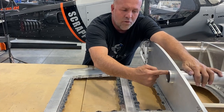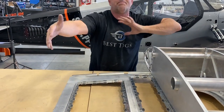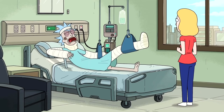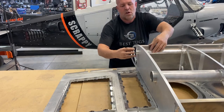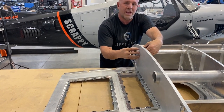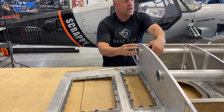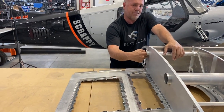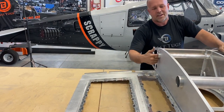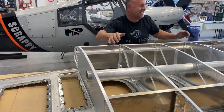Inside of it will be a torque tube, a half inch smaller diameter, that passes through that manipulates all the... This small tube you see here will have the same end bond joint ring. It's like an L-shaped washer donut, I guess, that goes on here. It has it on both ends. This is the pass-through cable that goes to both sides of the plane out to the aileron. So cable, torque tube, we're getting close. Let's get back to work.